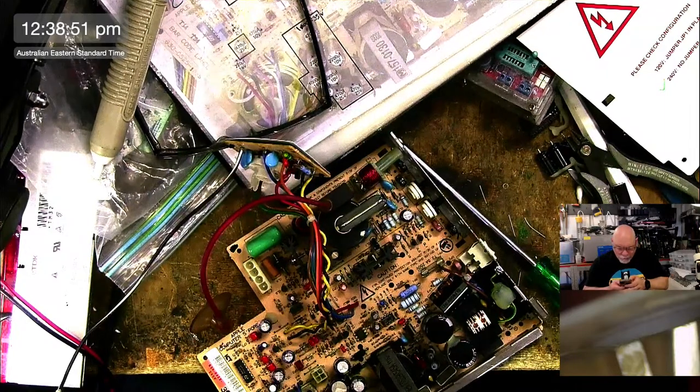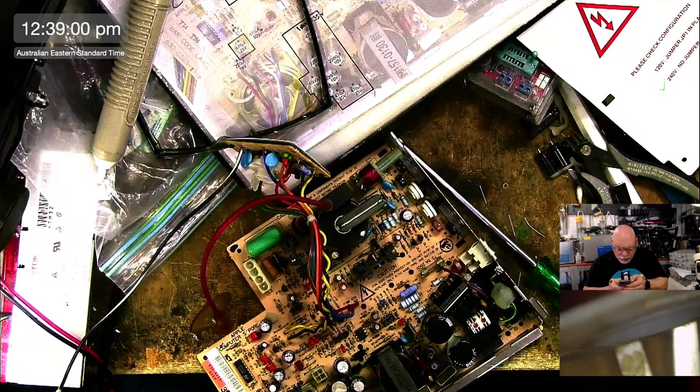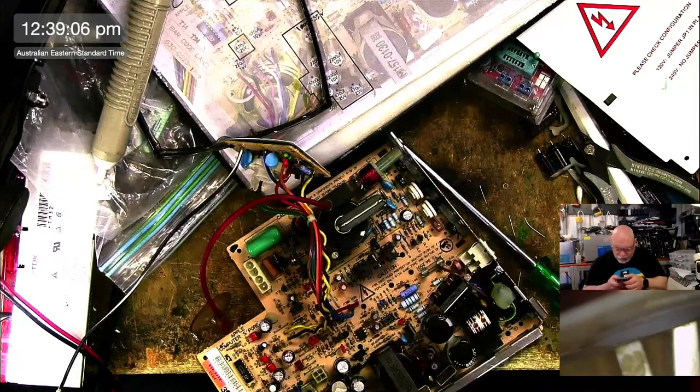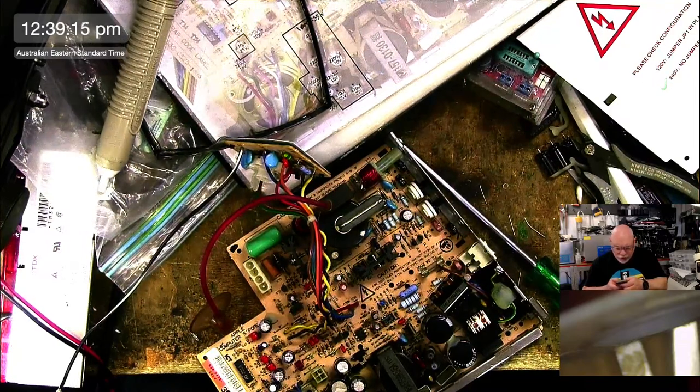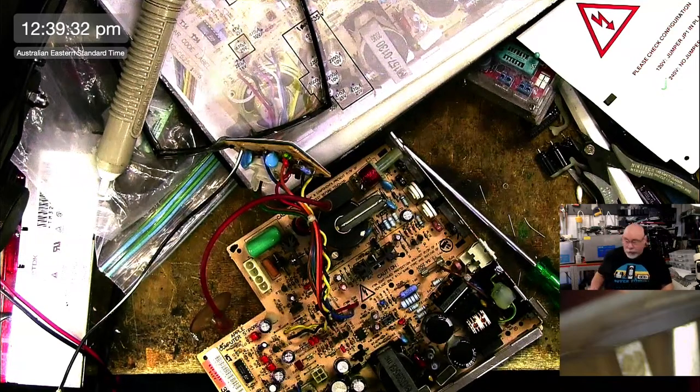J-Car. Let's go 2200 UF 25 volt. 2200 16. Was it 16 we're after, wasn't it? Yeah, 2200 16. Let's see if we can get some dimensions. See if it's a thinnish one or it's a little fatty. Description, features, specifications. Doesn't give me the diameter, which is a bit of a poo. All right, but I may end up having to go and do that.